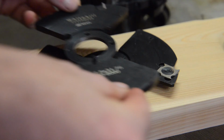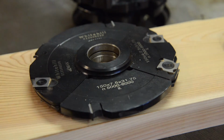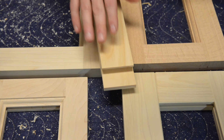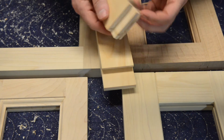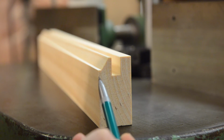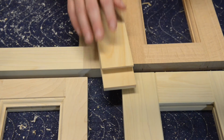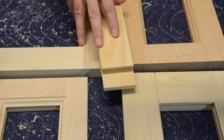Now, if you have an adjustable groover, you can make the comb joint at the corners if the widths are compatible, or a traditional mortise and tenon joint, as I mentioned a minute ago. Now, this is something else that I noticed when looking at this option. Because the stub tenon length in the standard configuration is so long, it's 15 millimeters, it puts the bottom of the groove well below the profile, which means haunching your longer tenon is easy because it's well clear of your profile, however you approach the haunching process.